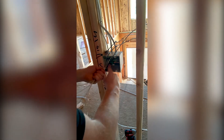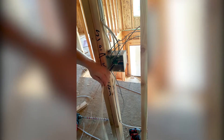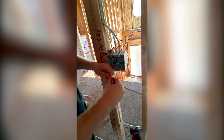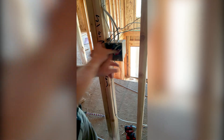Then you move on to your neutrals — the white wires. Take them all and push them into the back left-hand corner of the box. You want to be able to fold it the length of the box. Pull them out, cut them, and strip them back usually about a quarter to half an inch. Take your red wire nut and connect them together. Very important to make sure that they're all even so when your wire nut goes on you don't have any wire sticking out. Fold it to the box, in the box, all the way to the back, nice and tight.